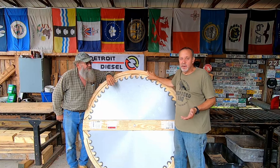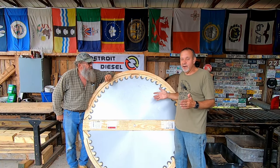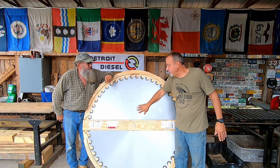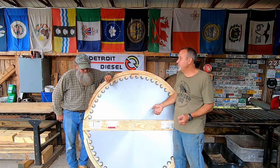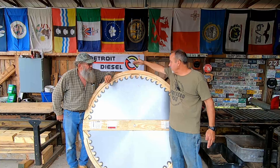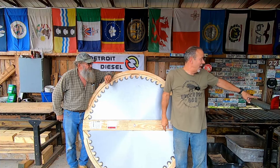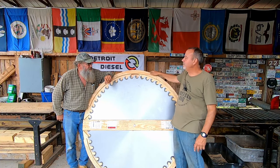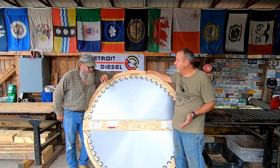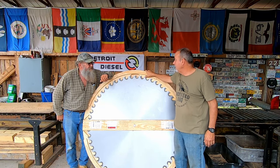It works for us. Also, on the end of the mill, between the saw blade and the off bearers on the husk where the belt ends, is 22 inches. We can cut 22 inches. You've seen a few times where Eddie, it gets jammed in there and won't even come out with this blade. Just imagine adding another 4 inches on a saw, so that's 2 inches wider, making it 24 inches. It would actually hit the pantograph column, and then the blade, and next thing you bent the blade and you've done damage. That's why we do not want to cut anything wider than 22. So that answers that question.